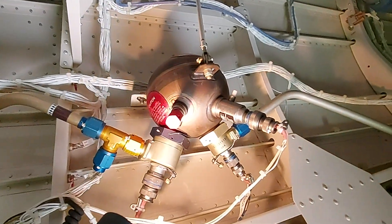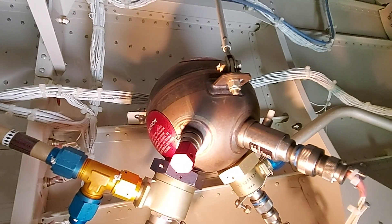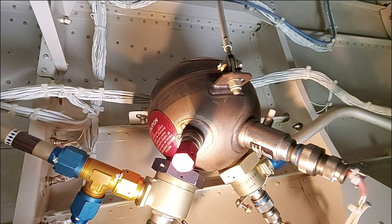This is the APU and baggage fire extinguisher. It auto-extinguishes the APU if fire is detected with an 8-second delay. It will not auto-extinguish the baggage compartment if you have a fire there. The white push-to-test button on the bottle checks the temperature-compensated pressure switch, which sends a signal if the bottle is empty. There is no other way to get information about the bottle pressure — it is just an EICAS message saying empty or not. Just to make sure: do not test it, this is a maintenance item.